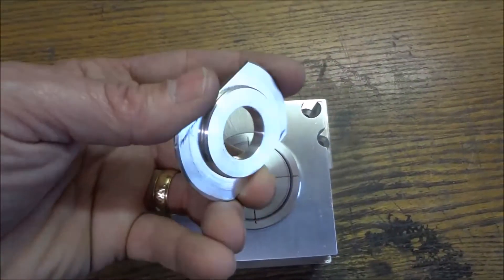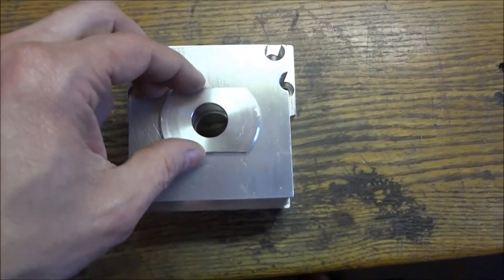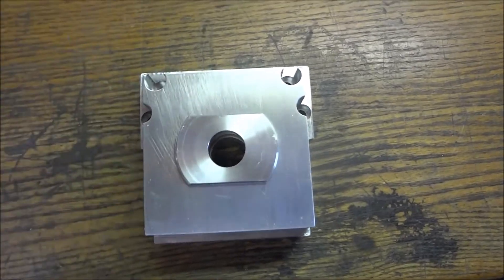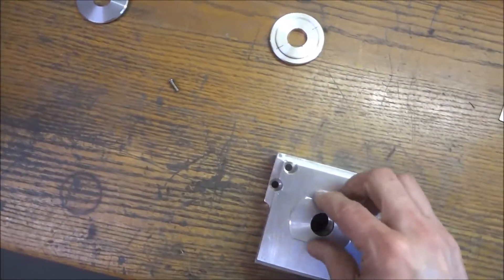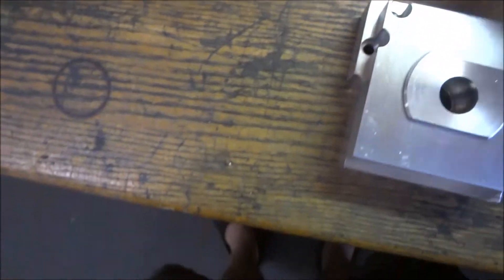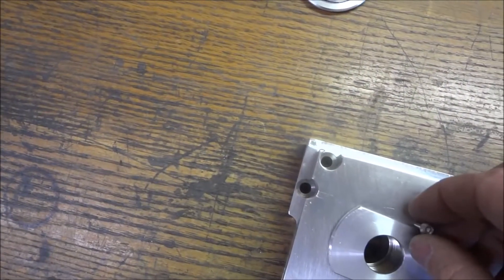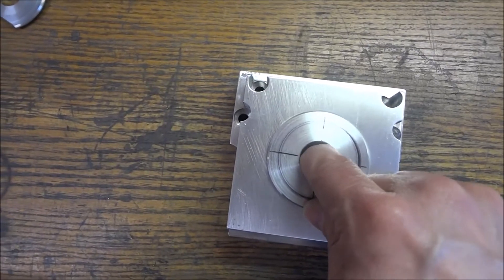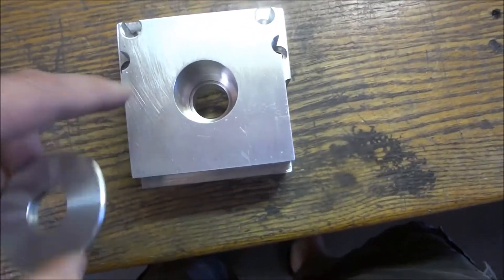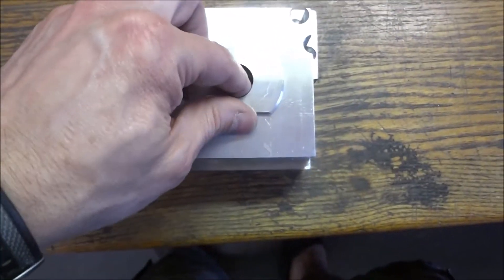You can see how our Y-axis bearing cover is going to look. It's going to have a 2x4 rectangular tubing go over it, and it's got a little side-to-side movement there. This will be for our Y and it'll have four holes as well. I'm going to use these little 4mm button head screws, 15mm long - they'll work just fine. I'll bore the first one for the X, then bore the second one when we do the bearing block for the Z, and when we do the bearing block for the Y I'll mark and bore it as well so they'll fit.